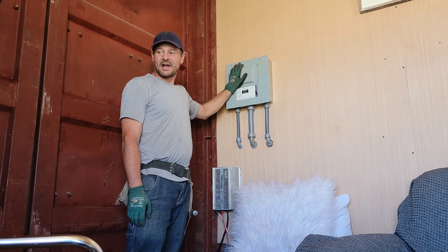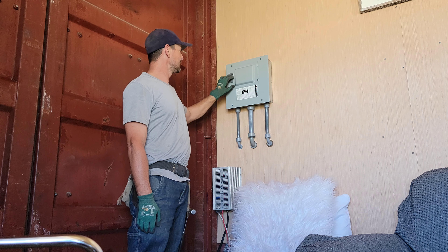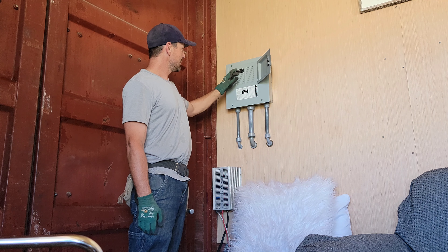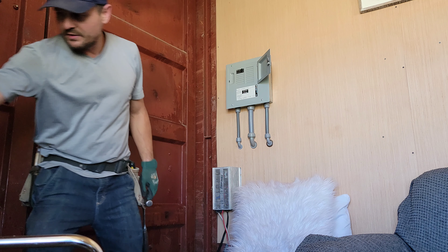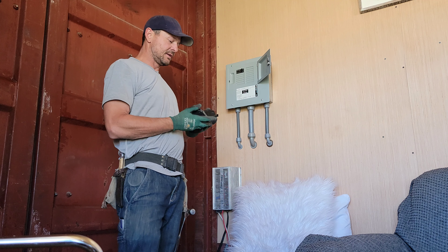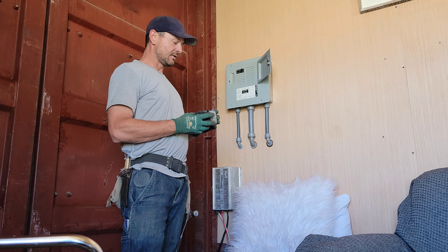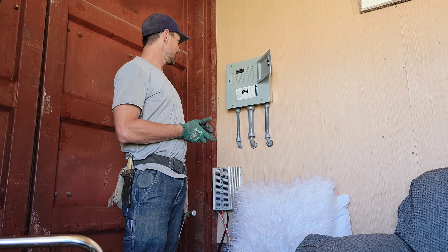It's time to tie in the power from the little cabin to this sub-panel. I'm gonna put these in the two empty slots — these are pretty small breakers. Everything's just gonna be 20-amp circuits, and all these GFIs are 20 amps as well, so that's what we're going for. I'm gonna go ahead and pull the cover off here. I've already shut the power off, so everything's good to go, and we're gonna stick these suckers in there.